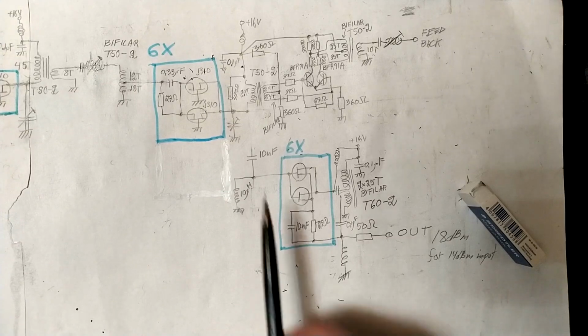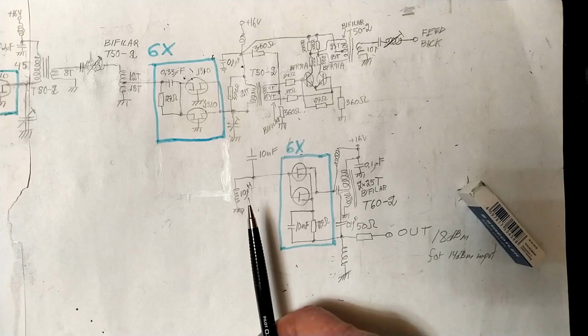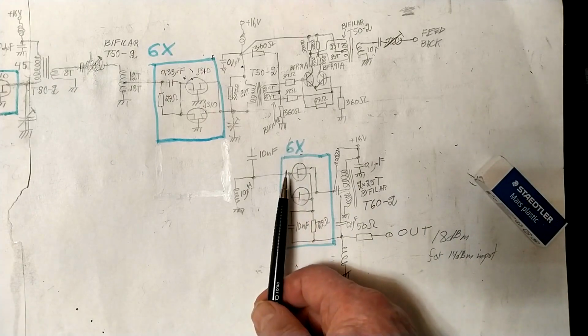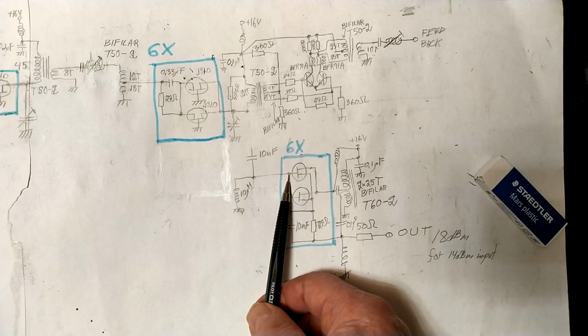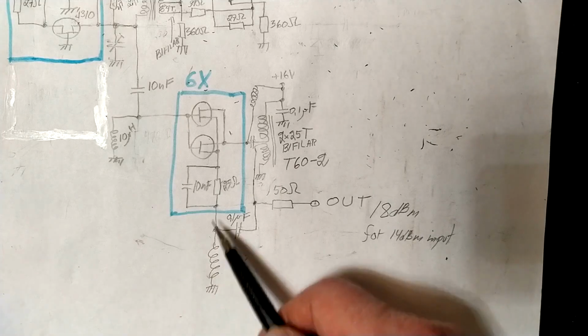And since when I had this connected, the phase shift with time that I observe is the same when I look at this output or when I look at this output when this was connected. And that tells me that the capacitance here, looking in here, is changing at random for unknown reasons. I don't think it is normal. It could be a bad soldering or a bad transistor, or maybe too many FETs like this do have this kind of unstable input capacitance. I don't know. I will try to find out. I have disconnected this inductor, so there is no current through the transistors now.